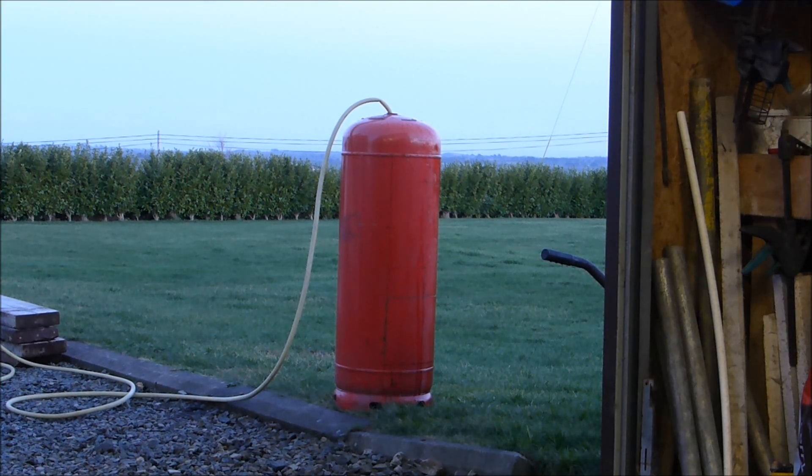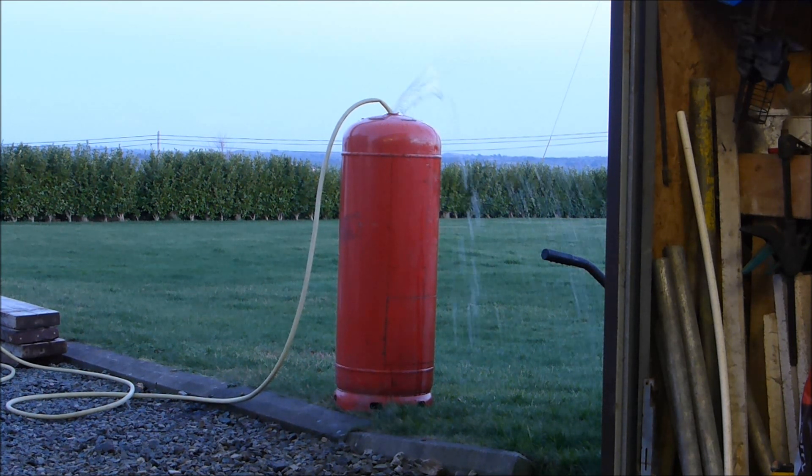I am just filling the cylinder with water to purge any remaining gas in it. I know there are other ways of doing it but water is definitely safe and no explosions. It is full — gas is purged.